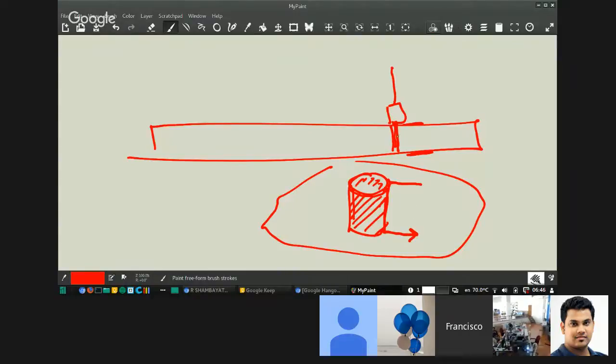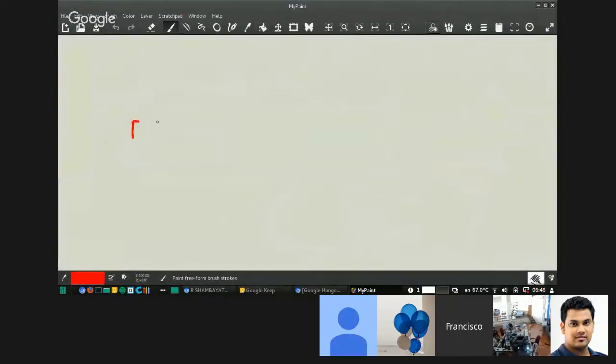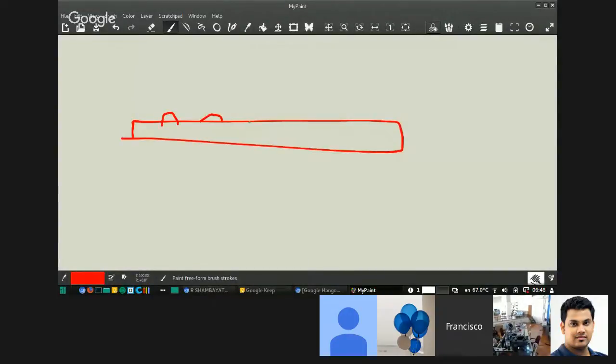But this board doesn't have that. When you make a hole, this side and the other side are not connected. So you need to manually make a via. Which means, like, if all your components are in here on your board, and this is the via, you actually have to put this in the other side. So when the pin comes in here, you solder in here. Yeah. And doing this, it means that this has to be symmetrical.